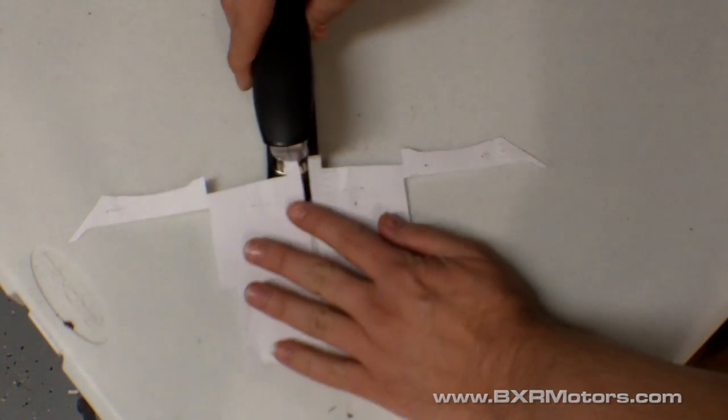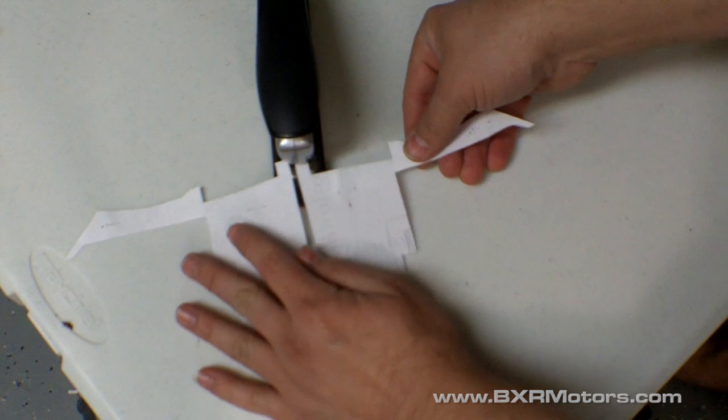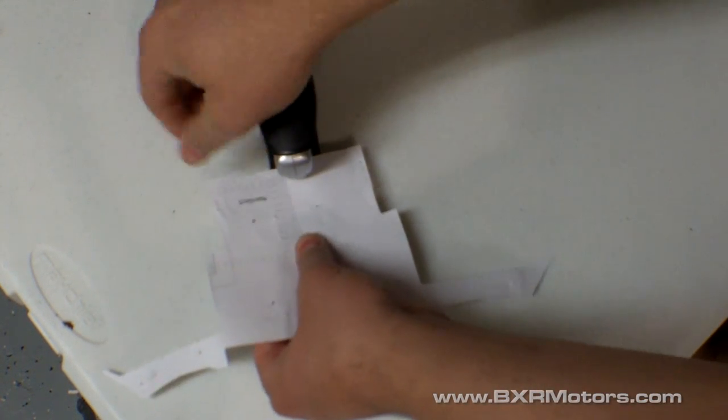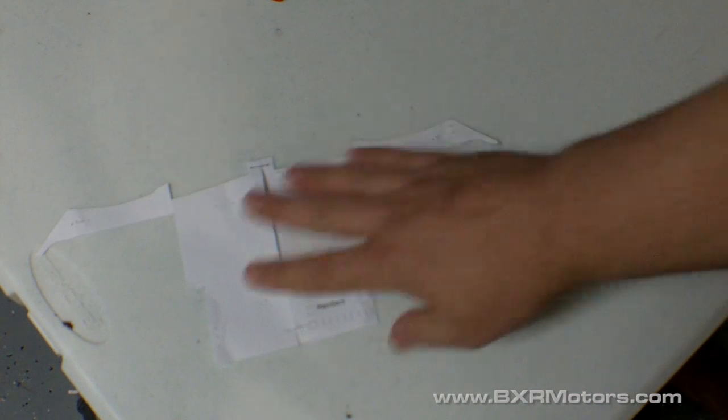This works the same way even on a smaller CNC — you'd just cut both pieces at the same time to reduce the number of machine runs. Then you come in and fasten them together — maybe with a piece of wood glued in between or something similar. That's a bit crude as a demo here, but you get the idea. That's how the two mirrored halves get joined into one complete symmetrical section.